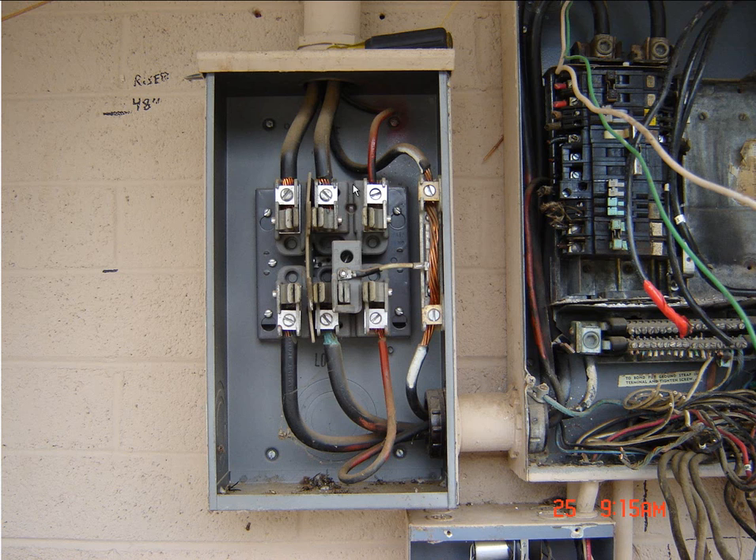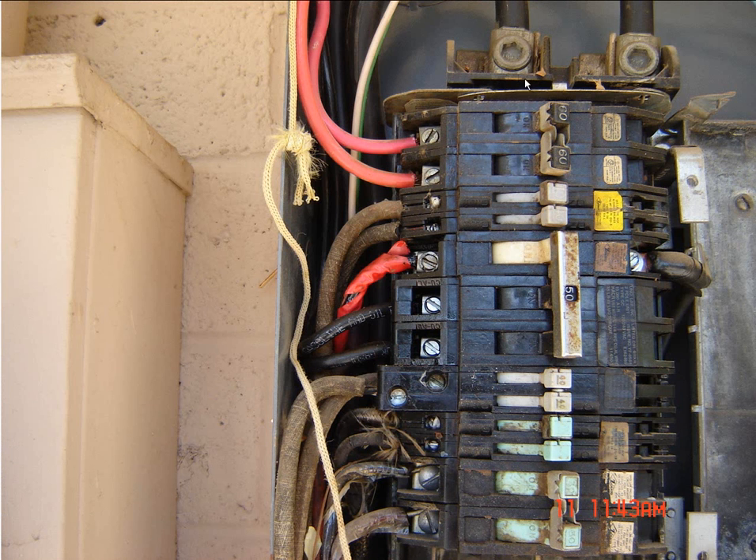I upgraded the panel and the new panel is a three-phase panel, and I will show you that in a couple pictures. Inside the single-phase panel that is being fed from the utility company's three-phase service, I have a three-pole breaker. These three-pole breakers are commonly known in my neck of the woods as a delta-phase breaker. This is my load side — this is my C, the high leg, and then A and B. This is fed directly off of the C phase coming from the meter, and then the rest of the breaker itself is fed off the bus bars, off the A and B phase.